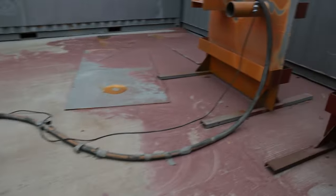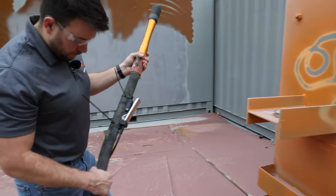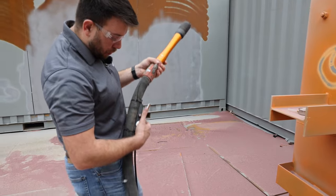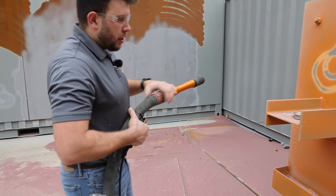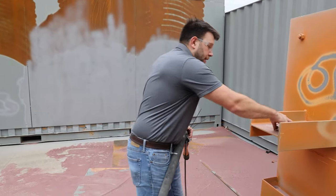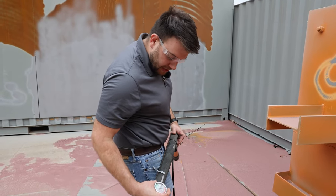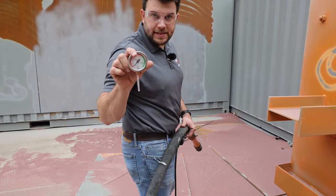And if you follow it around, you now get to the blast dead man or trigger and nozzle holder and nozzle. In a standard application, you would push in the safety and then squeeze the handle and you would be blasting under pressure. There are a lot of tools that people use in the field to tell if their blasting pressure is proper. One is a needle pressure gauge — you simply inject the needle into the hose facing with the abrasive stream, with a helper, and that will give you a live PSI test during blasting.